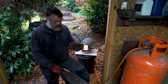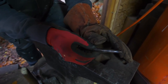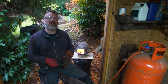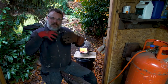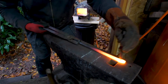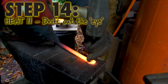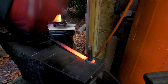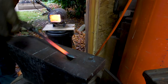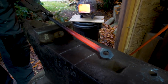And we're back. So next, we're going to use this — again, it's an automotive coil spring formed into not quite a point or a cone. It just makes it easier to go into that oval hole we've already punched through the steel. Why do we punch and not drill? We save so much steel doing that — we leave lots of steel in the part rather than drilling it all away. So, we're going to drift out our eye. Pop that there over the hole and drift that to, as near as dammit, half inch. Take that and bosh that through — just a quick little tidy up. Yay!